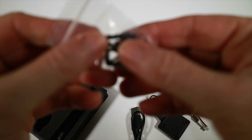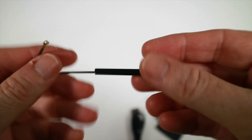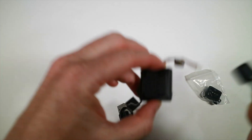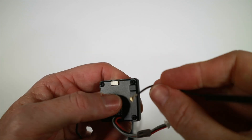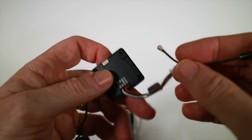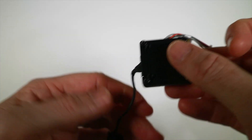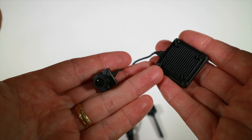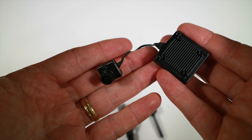You can see it's a pretty small camera, so you've got a mounting bracket that makes it a little bit bigger which might make things easier. You've also got this little UFL-based antenna - to put that on you basically unscrew this little bit here, clip it in, put it back on, and it keeps nicely. You've got these 20mm mounting holes here. A little bit different from the other ones - does 500 milliwatts of power. The very small ones tend to do 350, the larger ones 700 milliwatts, and I know they've just released a two watt one now.